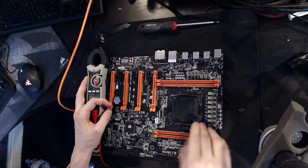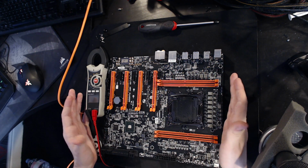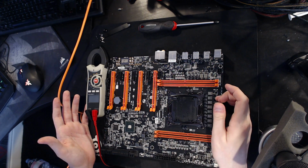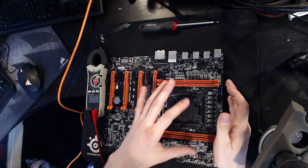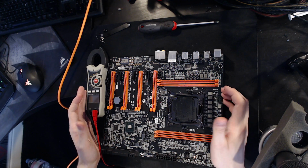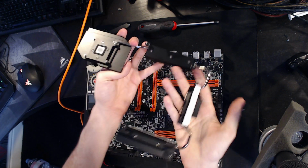So definitely at lower currents it makes sense. You're going from 300 amps for the whole VRM, which is about 37.5 amps per power stage, to 25 amps, so you get a huge current reduction. So for daily use, you're not actually going to be seeing anywhere near that 56 watt heat output. You're going to be seeing about half that, so about 28 watts. And this giant cooling block will take care of that handily.